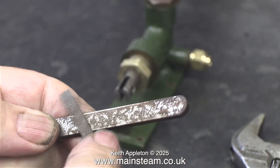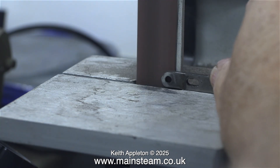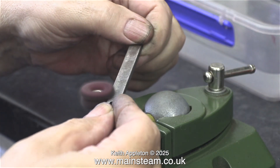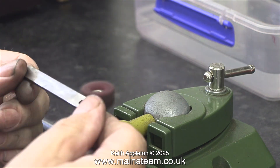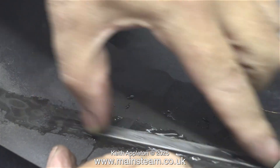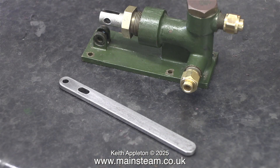The handle is very rusty. I started off by using a needle file but that was no good. I needed a bit more muscle so I'm using the one-inch belt sander. Rubbing this part very lightly on the one-inch belt sander's belt removed the majority of the rust. I tried to get rid of the rest by using the rotary abrasive wheel but it wasn't coarse enough. So I decided to use some 400-grade wet-to-dry sandpaper wet on the bench. That removed most of the rust and then I cleaned it up very lightly on the rotary scourer and it looks okay.